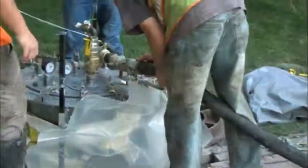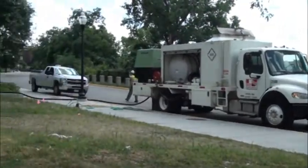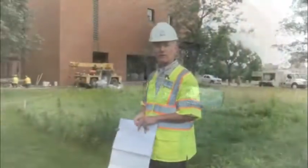With that done, they start inserting the steam. The steam is used to accelerate the cure on the epoxy resin, arriving at the structural liner. You can see them carrying it right now — that's why the steam truck is going in the background and the steam is coming off the truck.